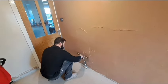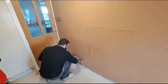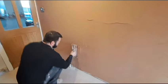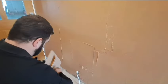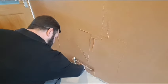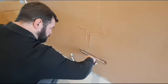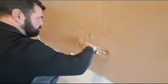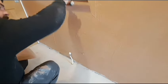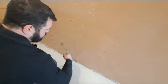Just the same as before — the same process, just going over again. I've got those little pesky screws I've got to try and work around. You can take them out and stuff little cotton buds in the holes where the screws were — that way if you catch your trowel on them, you'll catch the cotton buds instead and it won't nick your trowel. I've been doing this 20 years, so I'm quite confident I'm not going to do that. I'll just work around them nice and slow. Away we go.